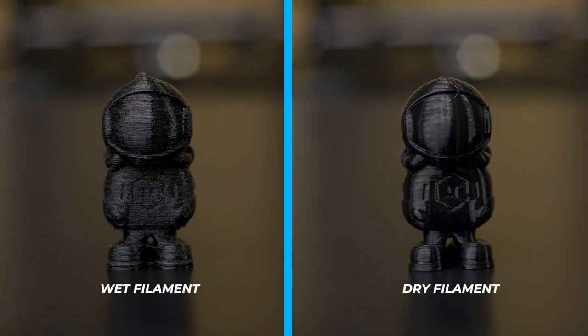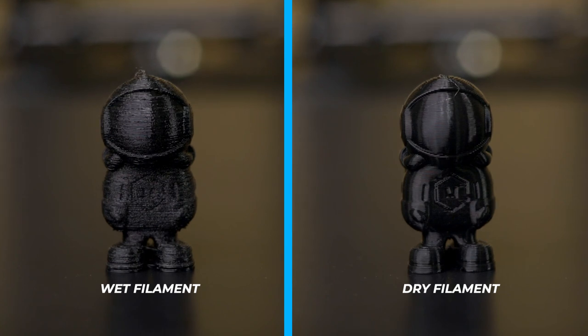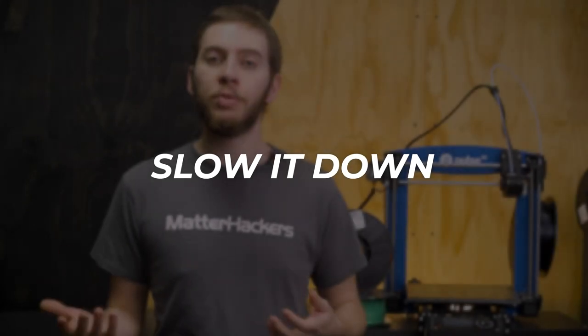Using the same G-code and spool of filament, I made two 3D prints — the one on the left was printed with a spool that had been sitting out in the office for an unknown amount of time, whereas the one on the right was printed after sitting in the print dry for several hours. Printing flexible filaments is like trying to guide one end of a rope by pushing the other. By slowing down your 3D print, you decrease pressure at the nozzle, lowering the likelihood of binding at the extruder gear. Some printers may have an upper speed limit of only 10mm/s with flexibles, whereas others may handle 60mm/s because of their more advanced extruder design.